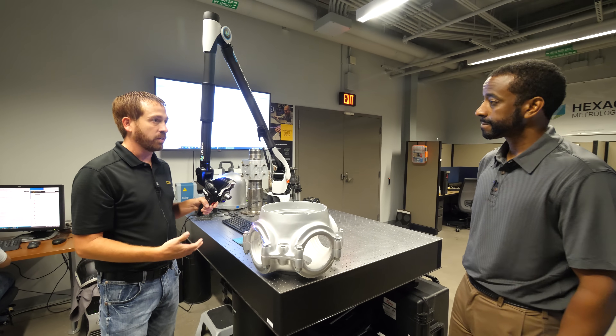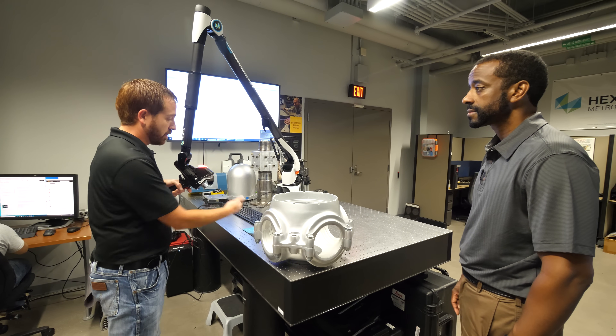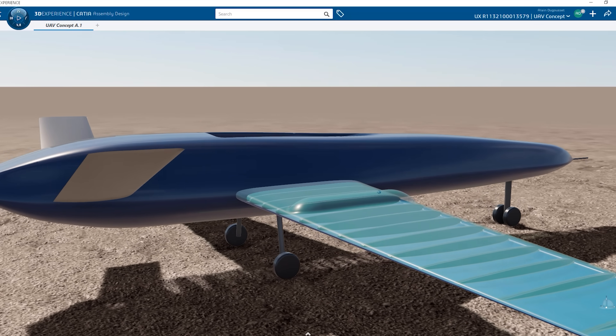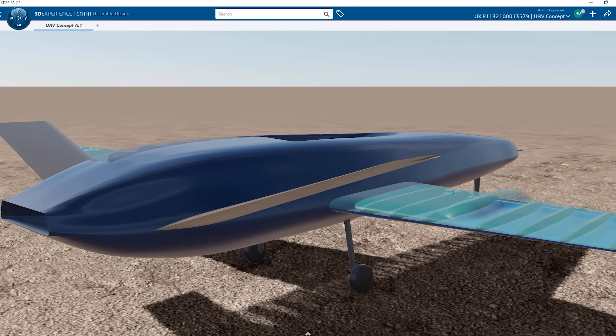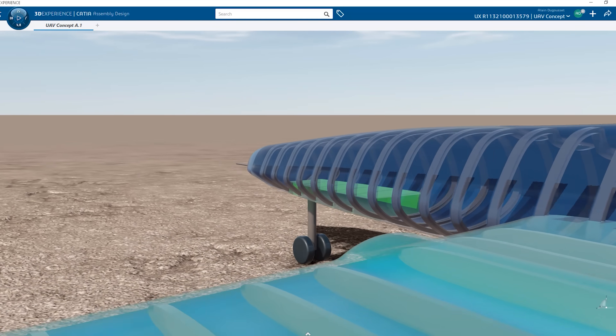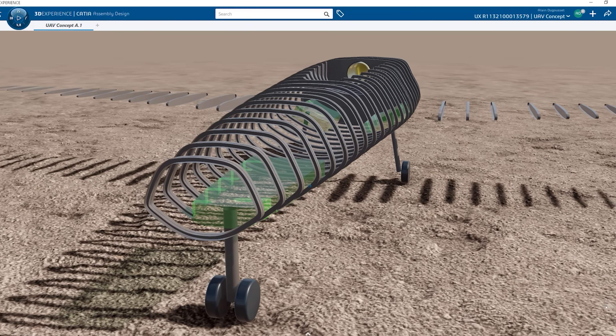And that'll show up on your scan — that's the level of accuracy we're talking about here. So they will lift the aircraft up on jacks and begin the whole scanning process. This scanning process happens at each stage of the disassembly. They will take off the outer skin and do a scan, and then as each component comes off, not only do the individual components get scanned, but the whole plane gets scanned at each stage of disassembly.